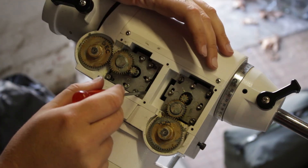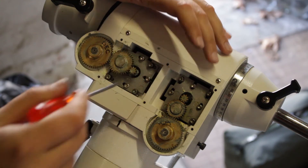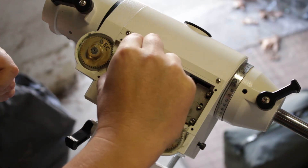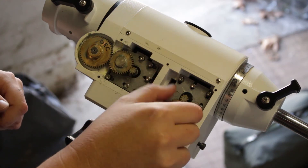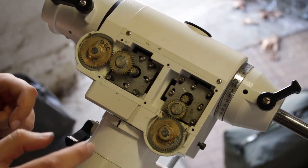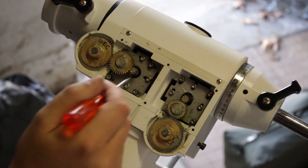Take the sliding plate and just slightly push it over, just a little bit — you don't want to force it — and then feel how the gears feel. I've got a nice smooth turn there just by that minute adjustment. It's not as stiff as this one. This one I've preset to a setting that I like, so it feels a bit better but I still think it's a bit loose.